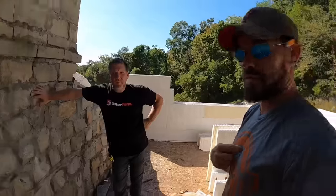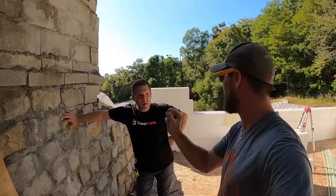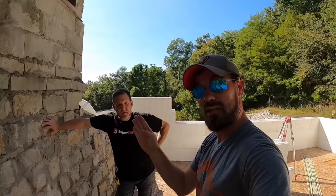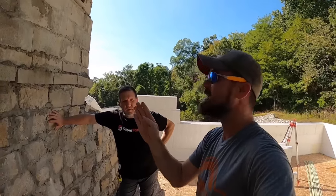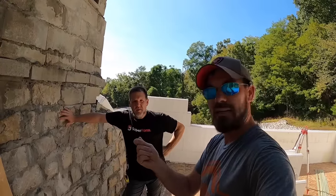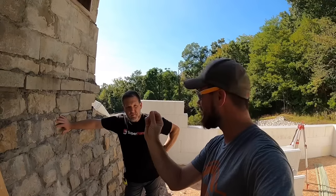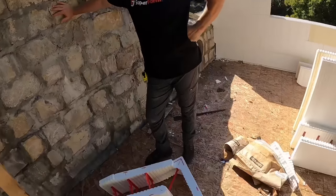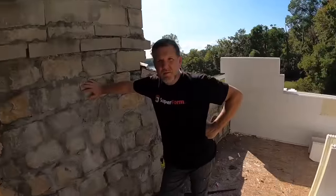And what I use is roofing nails, but the roofing nails with the five ring shanks on them. You don't necessarily want to use straight smooth because of the vibration that the wind creates, because you do not nail your siding down tight, for those of you who know that. Those of you who don't, you never nail siding down tight or it buckles. So you always make it to where your vinyl can slide. Well, since you're not nailed down tight, the vibration from the wind can wiggle that nail out if you don't use ring shank roofing nails. So as long as you have ring shank, you can just use roofing nails to attach your vinyl siding to the outside, your vertical siding, whatever you choose to use.